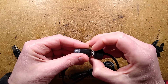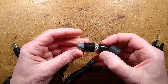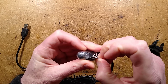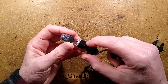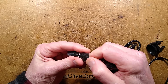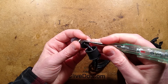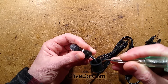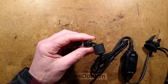Let's take a look in this first. I shall peel the rubber back. It's potted in resin, and I think the heating element is potted in resin down at the bottom. Let's pull this label off and see if it reveals anything underneath. It's just basically granules, like sand or something for thermal coupling, and they've poured in silicone resin. I'm guessing the circuit board here has a thermistor on it. I'll pause a moment while I take this out, because otherwise things are going to take a while if I don't want to destroy it in the process.